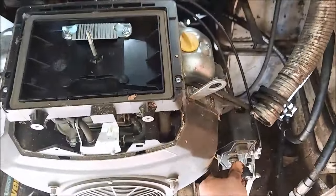So this is just basically a pipe that's going to go around back and connect to there. It's got to pick up the two exhaust ports. Yeah, we'll get ready on that. And then all right, so the new old muffler or whatever is bolted back on there. And to get my clearance, I need to cut it just right before the bend on each side. And I'll still be good, I believe.